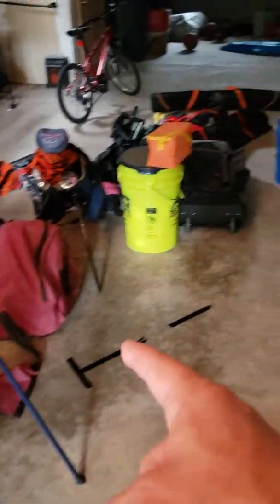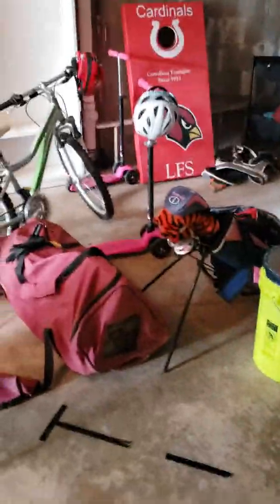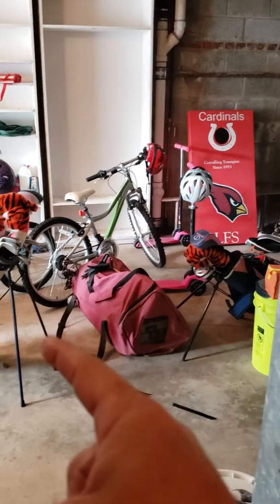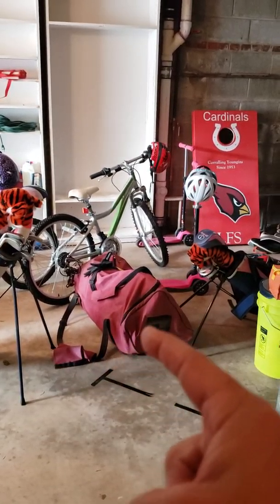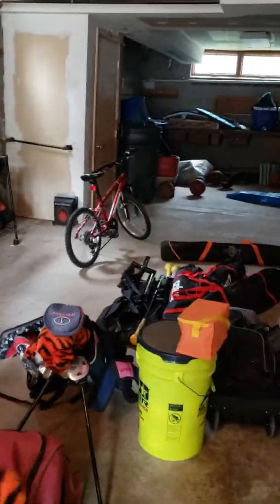Moving forward, we have to expose the sewer from here and through here. What I'm recommending is, since we've already relined from right here on, we might as well just go back that eight feet to that stack right there and pull out all that old cast iron, because the old cast iron is what we're having a problem with. So all that being said, let's just call that 10 feet.